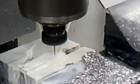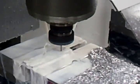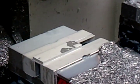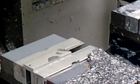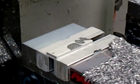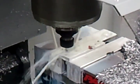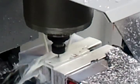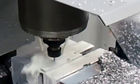It's a lot more precise than hand sanding. What's nice about this is we can cut 25 and they'll all be exactly the same — within a thousandth of an inch — as long as the drill bit's not worn out. We always cut a couple extra pieces. One time Christian put one in and there was a little aluminum chip under it, so it sat just off a little bit. Each one that comes off the machine, we check it. He pulled it off, checked it, and said something's not right here, so we had to put that one in the scrap.